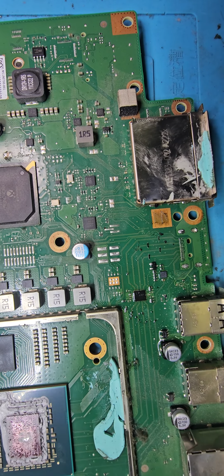And my tip just bent some plastic, so now it's better. And what's wrong with my microscope light now? Okay, that bridge is gone. I think it's even better without the light. There we go. Okay, I'll use some alcohol and patch off that area to see if we've got a bridge or not. Yeah, now we can clearly see that there's no bridges. If I put in some heat to blow away that alcohol, you can see we are good. We don't have bridges on any side.